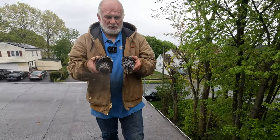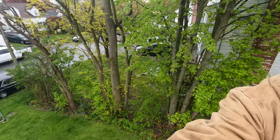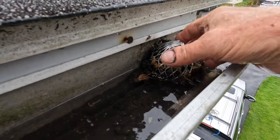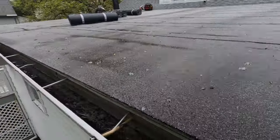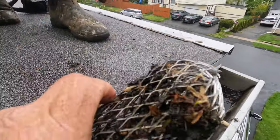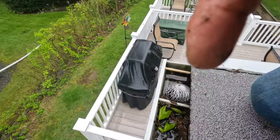These are plugs — don't plug your downspouts with this style. The worst gutter filter is this type. You cannot use this; it's a plug to the downspout. It's not a filter. Look, it's plugged, it's full of debris, and look how the water can't flow down. If I remove it, you can see it fills up with leaves and small debris and moss that plugs the downspout. Never, never use this type of so-called leaf filter.